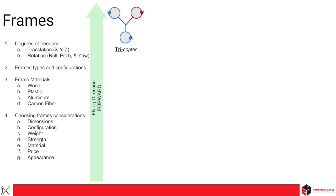Now, if you recall from your quadrotor dynamics lecture, what is an issue with this particular tricopter configuration? If you said it is rotationally unstable, that is correct. All the forces and all the moments need to sum to zero for it to be stable. Because two rotors are spinning counterclockwise and one rotor is spinning clockwise, this is rotationally unstable. This is where the quad comes into play.